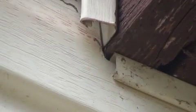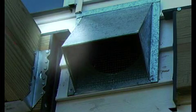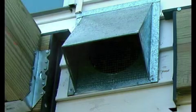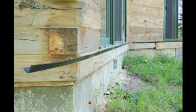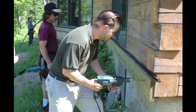Here's another spot water usually gets in. The trick is to run the top flashing past the end of the ledger. And for the side flashing, create a kickout where water will come out over the top of the siding if it gets in that area. In this situation, there is no siding to run the leg of the flashing up behind, so we've cut a groove into the lumber and created a downhill slope to that flashing that will direct the water over the front of the ledger.